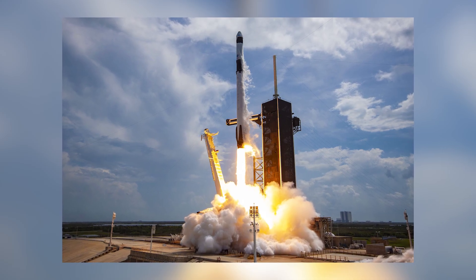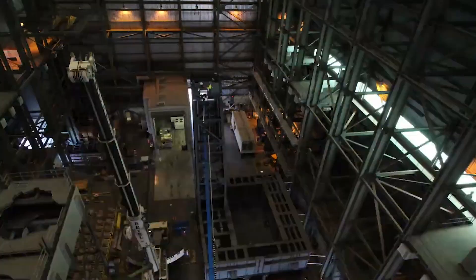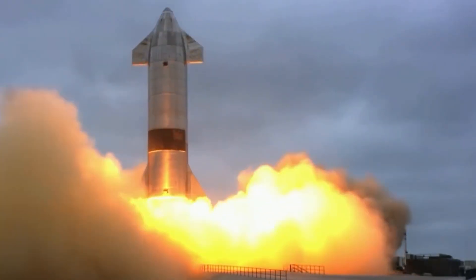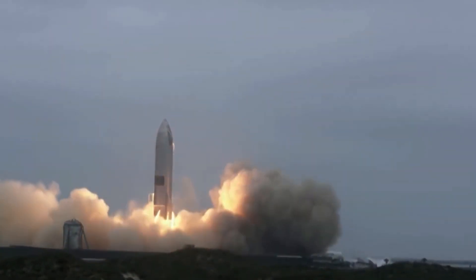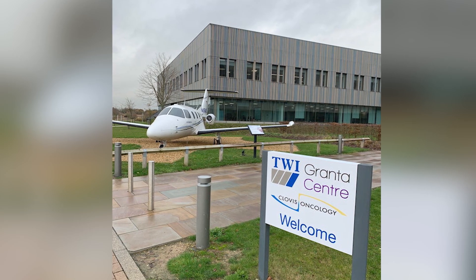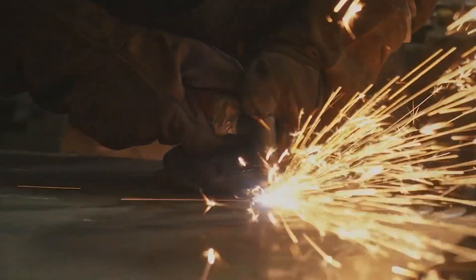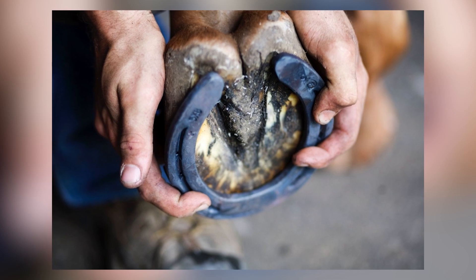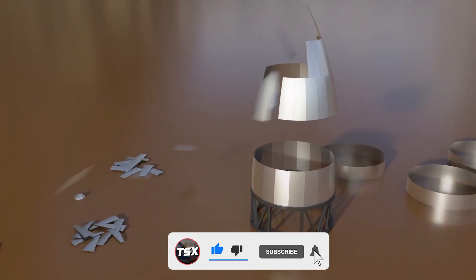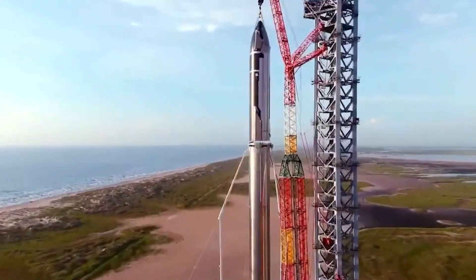This is great for space applications such as Falcon Heavy launchers and the Starship. It works wonderfully well to melt the stainless steel sheets into one another while still achieving a smooth weld without leaving any rough-looking surface, as in the case of arc welding. More importantly for Starships, you can link materials that you can't physically weld together using a melting approach. TWI first patented the technology in the 1990s, and the patent expired after 20 years. One of the first major benefits of friction stir welding was the ability to use aluminium for space travel, which completely opened the use of lightweight, super-strong alloys for spaceflight.